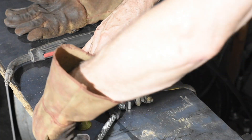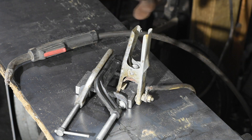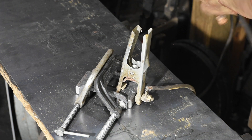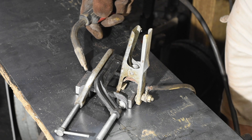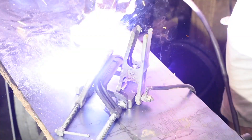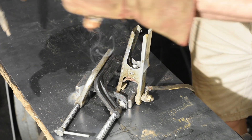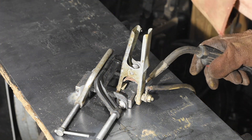It's time for me to show off my golden welding skills. In all seriousness, welding with flux core, you're never going to get that beautiful row of dimes they always show you in the welding instruction books. As long as it holds though. I've tack welded the parts together, then once they're stuck, I'll get the clamps out of the way and lay in the final welds.